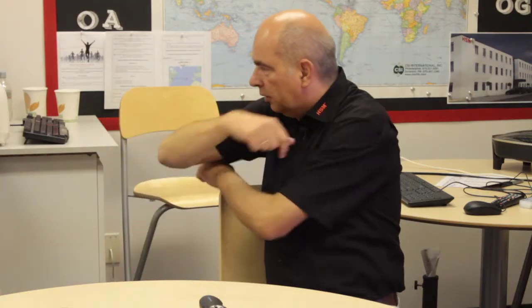So when you are doing the adjustments on the side guides and so on, do you do that with the press ram in the home position or in the extended position? Where is the best access for that? I normally think in this case the best position is the home position, and you can reach all the positions. Otherwise, you have to remove the top of the press ram, the table of the press ram, then you can come inside. You can also work from the press hopper side, but it is not so huge. So small technicians can come in, and some other guys have a little bit of a problem.